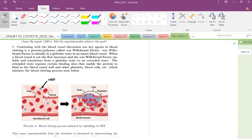Yet another video on how we deal with strain gauges and how we measure mechanical properties of materials, i.e. stress and strain, when we're using a Wheatstone bridge configuration. Today we're going to talk about a new problem we haven't really done yet, which is using strain rosettes.